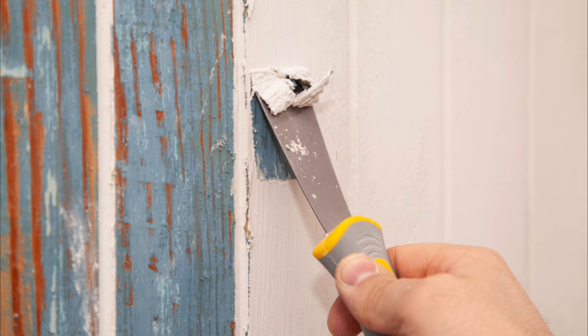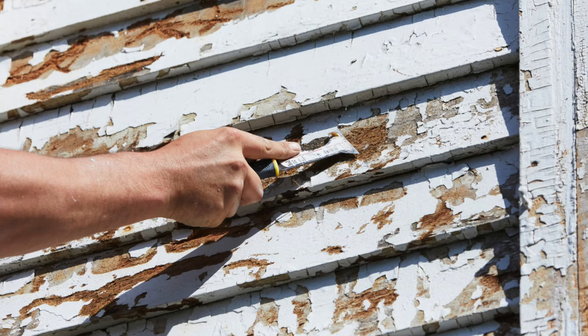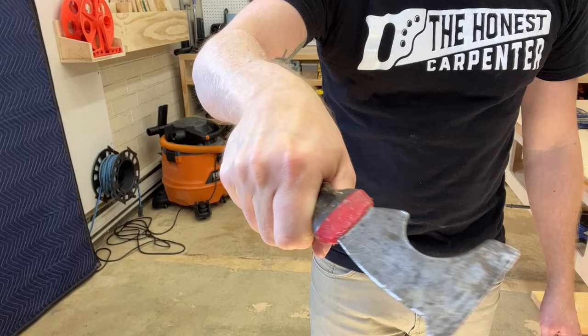Number four: scraping carelessly. Most people don't realize how dangerous just scraping stuff is — and I really mean scraping anything, including rust, paint, or wood, using a paint scraper, a 5-in-1, or any other flat knife tool. When you hold a scraper, your fingers are often pointed in line with the direction you're scraping, and the chips tend to travel straight up the scraper. A lot of these chips surface as very sharp objects. If you're driving forward repetitively with a lot of force, you can get chips lodged in fingertips, knuckles, or even under fingernails — it's horrible. Consider using a glove when scraping, possibly even a Kevlar glove. If you don't have one, scrape in smaller strokes and keep your fingers curled on the tool. It may save you from the most painful chip splinters.